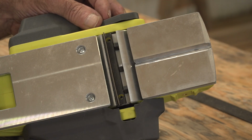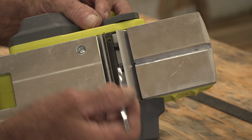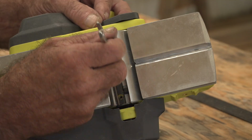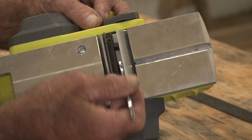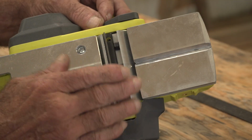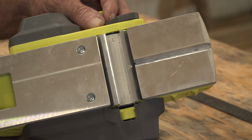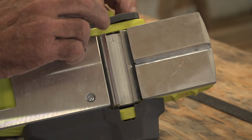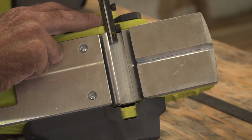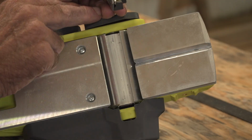It is in 3 pieces because the pressure bar is in 2 pieces and it kind of falls apart. So you have to be pretty careful that the blade is in the slot the way it belongs. And I'm just quickly going to tighten up one just to get it to sit still. Just like that. Just lightly tighten it up. Now I'm going to roll it around. And I'll pick up my other unit here and slip that in place. I'm just going to go in just a little bit. I'm going to push this bolt in a little bit deeper.